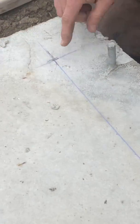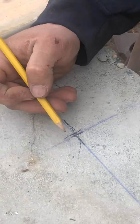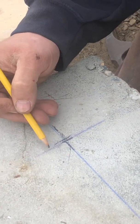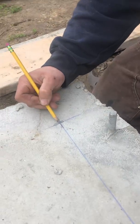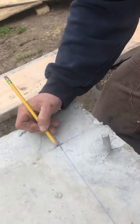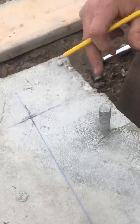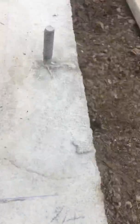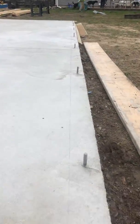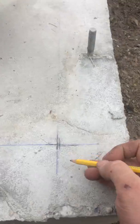Can you see this blue line right here? If you take a look at this blue line, you'll see how I came in an eighth of an inch from my original line. Now, luckily on this pad, when we went from front to back — down this way — it was 30 foot exactly. So our four-inch lines right here were perfect.